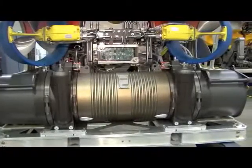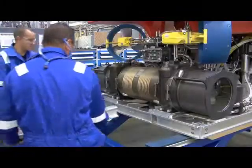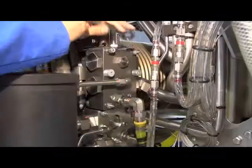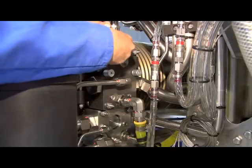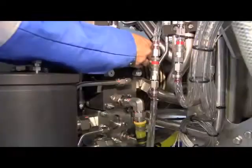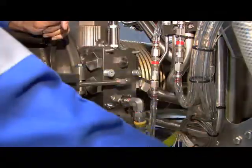The main hydraulic power unit is an integrated system that can be rapidly changed out using a tray that attaches to the base of the ROV. The HPU mates with two manifolds and is disconnected by simply removing the securing fasteners without disconnecting any hydraulic fittings.